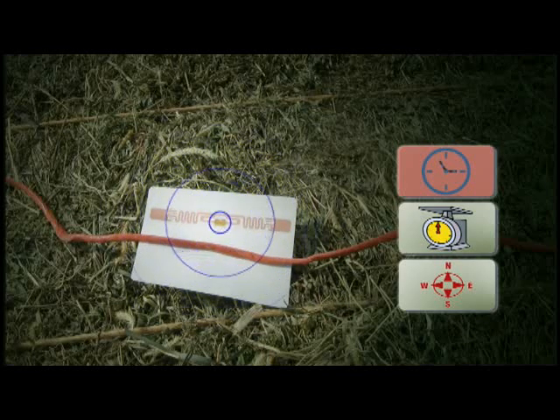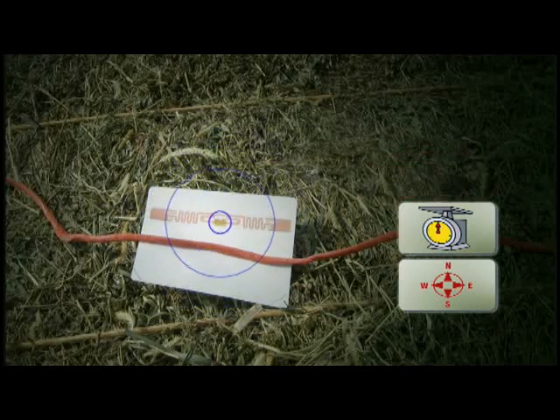And later, when you or your customer says that was great feeding hay, give me some more of that — you can identify it. Bale weight: AGCO has developed an optional scale for their large square baler. If your baler has a scale, the tagger will write the average weight of the last three bales made to the tag of the bale currently being made. If the bale does not have a scale, you can watch the pressure and crop conditions and put a pretty good estimate into the system. It will be on the tag.